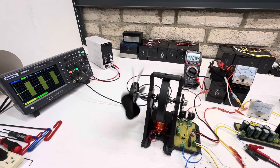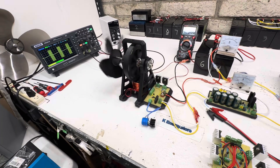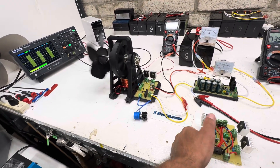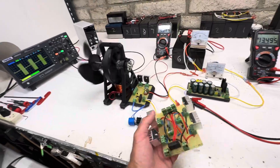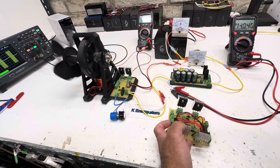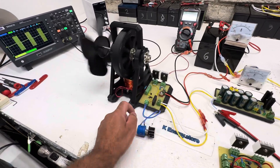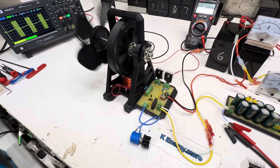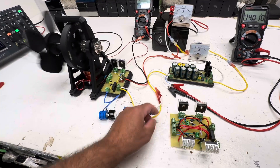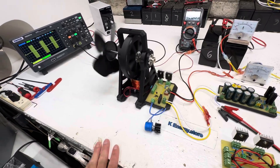Welcome to my channel. Tonight's another Bedini motor - I've been doing a lot of work on these this past year and have a whole new circuit for you guys to check out. It's the bipolar switch, which is a Bedini coil switch. This is the full bipolar switch that actually needs two different trigger wires, unlike the single version. This one is basically like a half H-bridge, but nicer because on the other one you'd have to tune each one while it's running and you have two separate circuits.